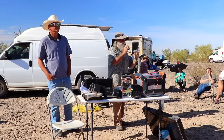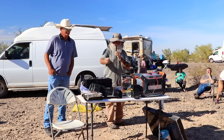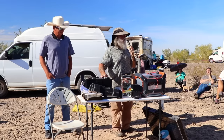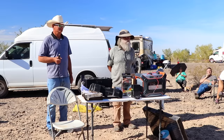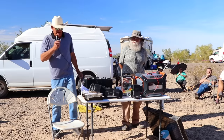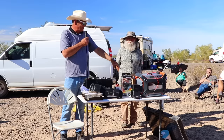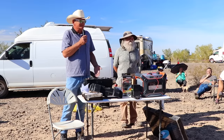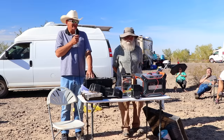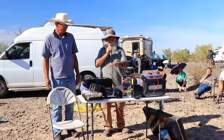For $600 versus $1,600, I'm sincerely recommending this DIY approach. You don't need two batteries with two panels — sometime during the day this battery becomes charged and all the power from the solar panel you can just use directly. If you've got two batteries, I would suggest getting two solar panels, because you want a good ratio to keep them charged. Otherwise you'll damage them. You could also buy two panels going into one battery.